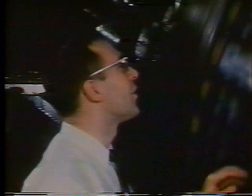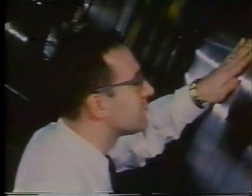The sphere is the pivot for telescope support and rotation. It is machined from a single casting and is certainly the largest ever poured in 3.5% nickel steel. Unusual tooling was required to machine the sphere to a tolerance of 3 thousandths of an inch in both sphericity and circumference; it has a plate glass finish of between 10 and 20 micro inches.